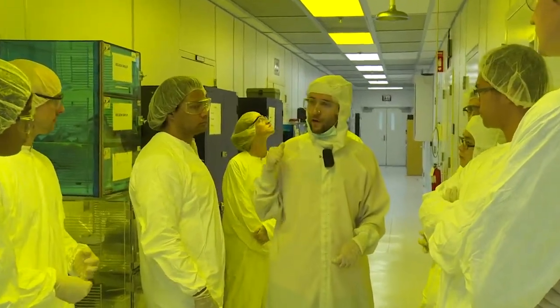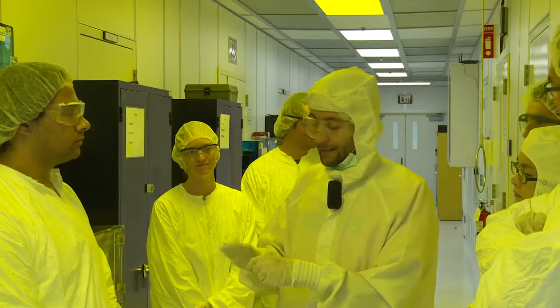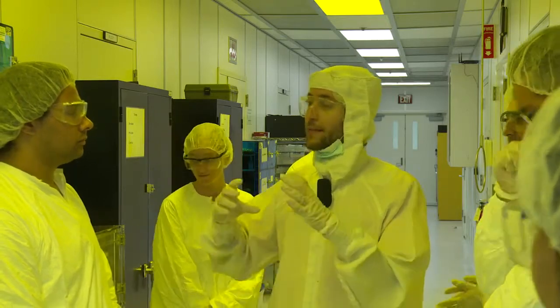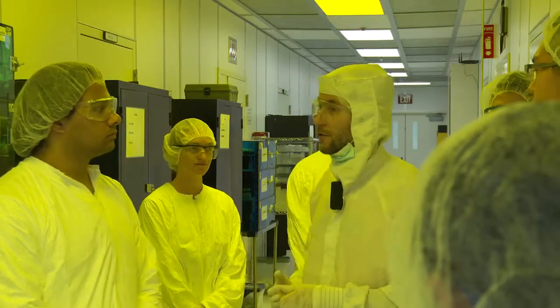For example, there's a kind of photosensitive material that is very cool. It's an epoxy that works the other way around. Where the light hits, it hardens, and where the light doesn't, it's still liquid, so you can remove it. The funky thing is you can do very thick layers, so you can create your device with that epoxy. You don't have to process it anymore. You just do photolithography, and then you have your features. If your features can be non-conductive, that works perfectly. If you use a semiconductor like silicon, then you cannot use that.